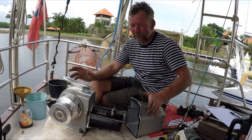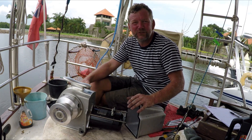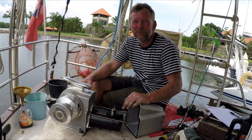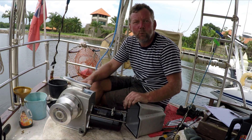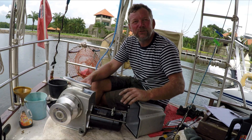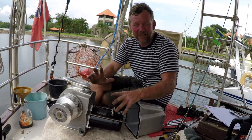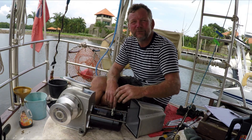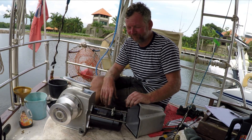Before we took it off the boat and got it on the back deck, we did a couple of checks - primarily to make sure we were getting the right voltage through, and that the problem wasn't just down to some dodgy connections. After four or five years on the boat, there was a possibility of corrosion on the connections or in the relay box. We re-cleaned all the motor connections - the negative and two positives - traced back to the relay box, then all the way to the battery, and volt-tested to confirm good voltage.